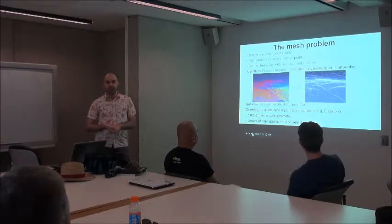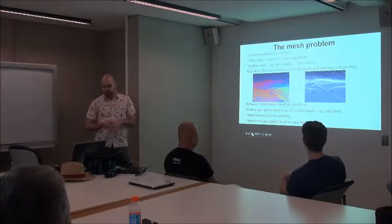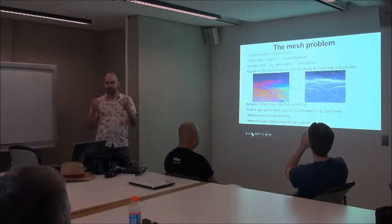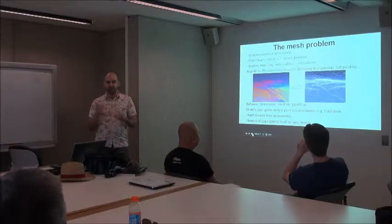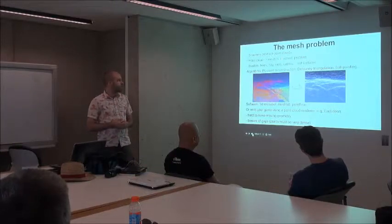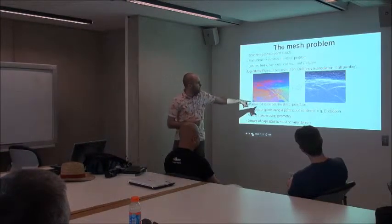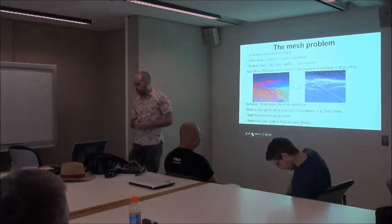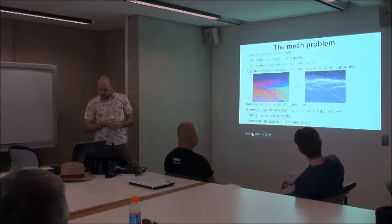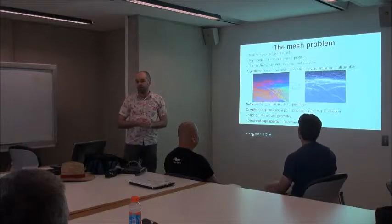And certain things don't mesh well at all. Bushes, trees, big bales of hay, nets, cables, birds' nests, weird fir trees, strange things like that. They're not really surfaces, so they don't mesh well, which is a problem. Anyway, there are several algorithms out there that you can use to mesh as best as you can. A very popular one is Poisson reconstruction, and that's in the picture: that's a point cloud, and that's the mesh that it's produced. There are other ones: Delaunay triangulation is quite simple, ball pivoting, etc. And there are different bits of software you can use to mesh your point cloud.